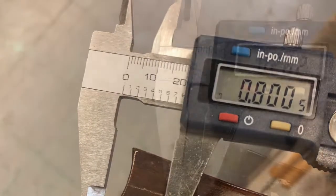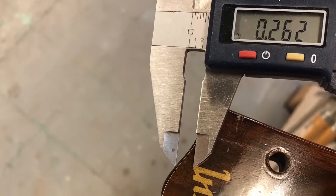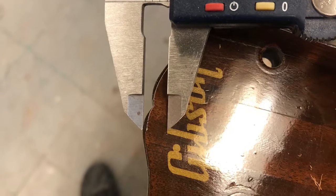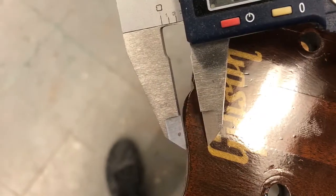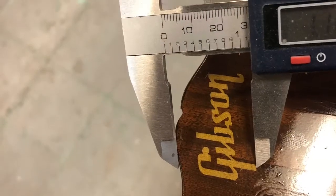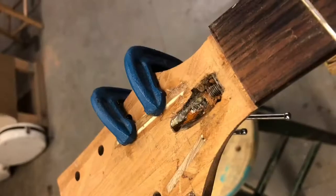So what we did is measured it all up and made sure I had the decal in hand. I machined about a hundred and eighty thousandths of an inch off the back of the headstock so I could put a back strap on, similar to what Taylor Guitars does in their new guitars. Then a new headplate veneer — both the back and front veneers were made from mahogany.